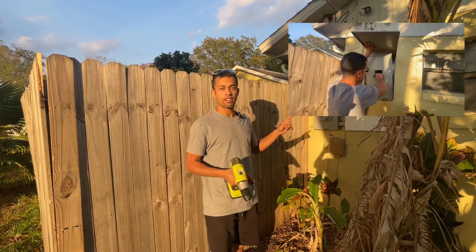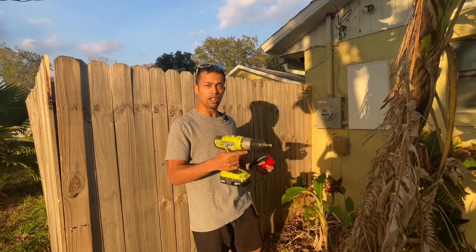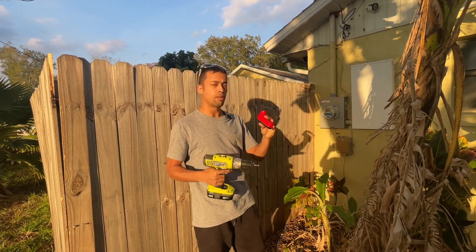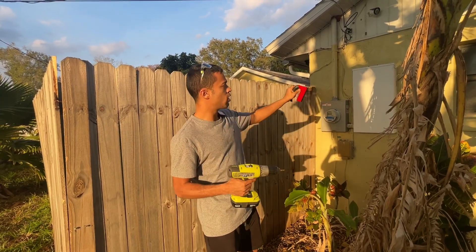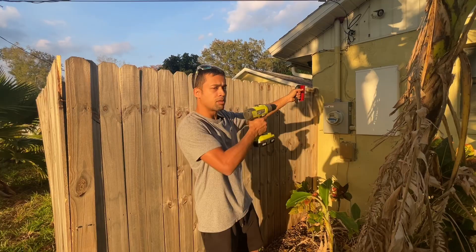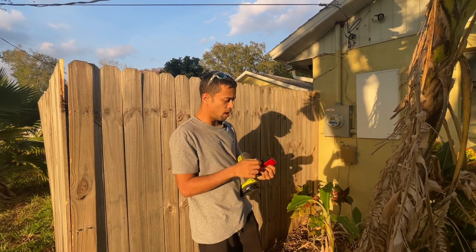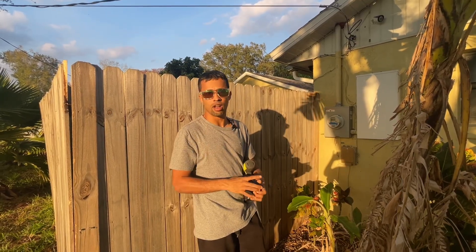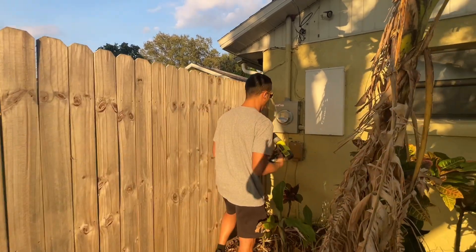Today I'm going to be showing you how to safely open an electrical panel. We're going to be using a drill — though you can also use a manual screwdriver. I'm also going to be using a magnet to help keep the panel in place while maneuvering with the drill. I'm wearing safety glasses as well, in case there's arcing so you can protect your eyes.